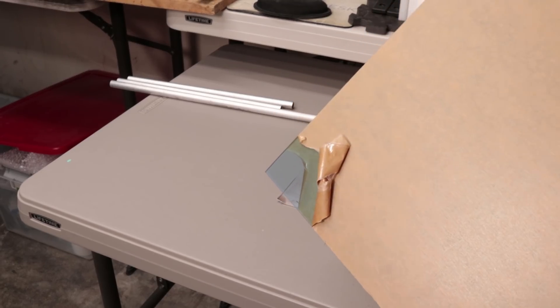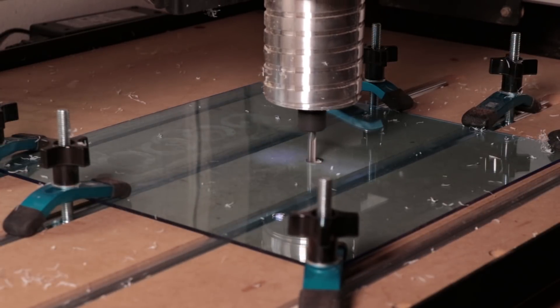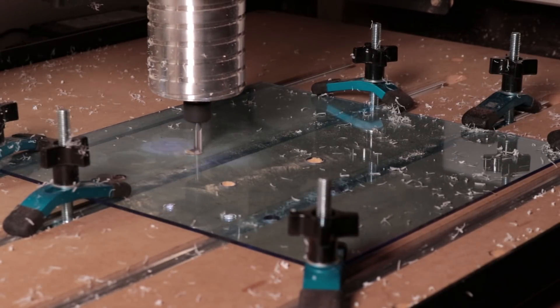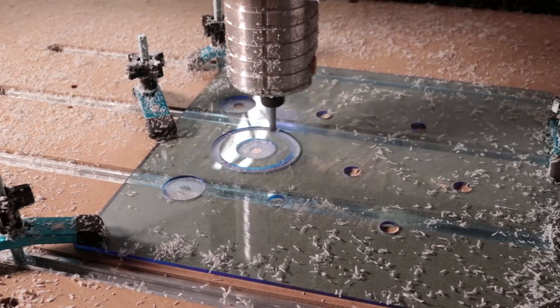First things first, let's turn this translucent blue piece of acrylic into the light diffuser for the turrets and also for the hover rings down below. And then it broke. I accidentally screwed up the Z offset, so it took way too deep of cuts and ruined the pieces and shot one of them across the room. Very fun, by the way. Thankfully, I was able to recover the diffuser pieces, which are the most critical parts. No little hover rings — oh well.